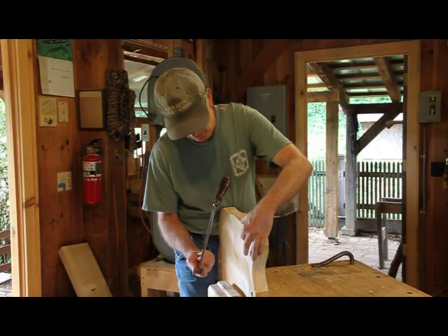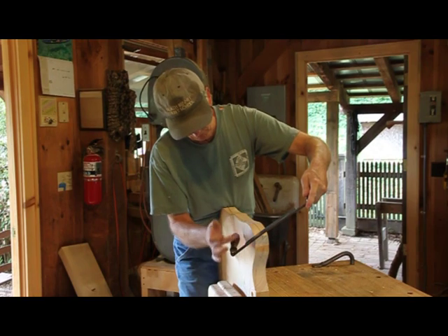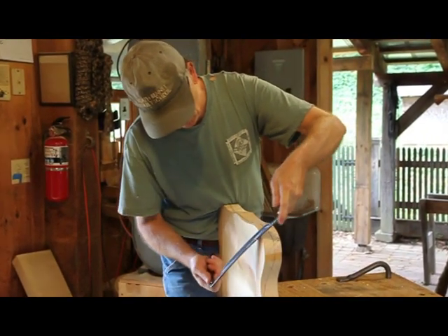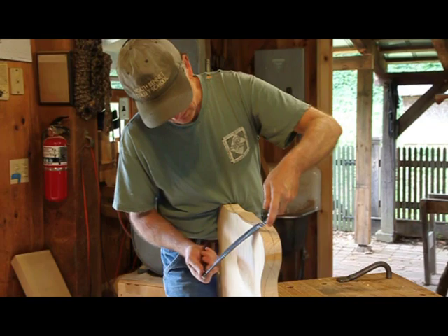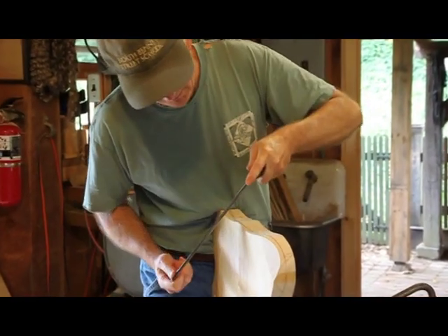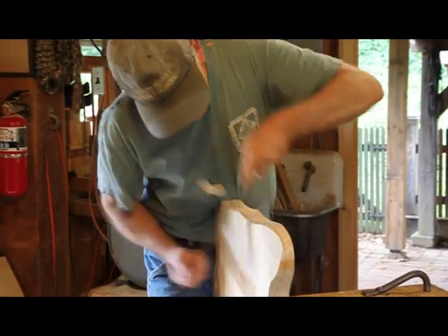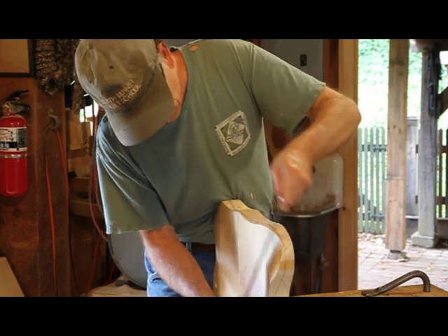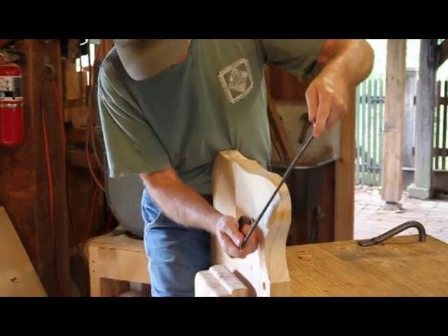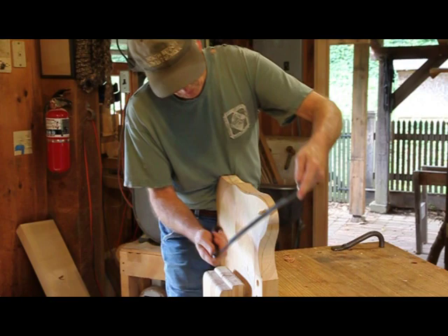The way I use the draw knife cutting off this section is you're trying to use the whole entire knife. I'm starting way up here on one end and pulling right like that — so I'm slicing, and I've also got it skewed. You can take some big cuts like that. You can get way back up here by getting that handle down into the seat. Otherwise you're limited — if you don't get the handle down to the seat and you're cutting up here trying to get back there, you can't do it because the handle's hitting. That's the way I get so far down there.